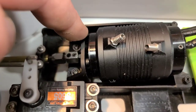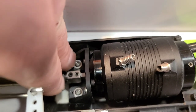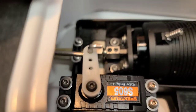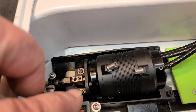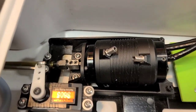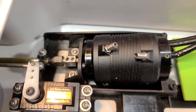I've got my motor screwed up. I've got Loctite on the head screws, and I've got these screws tightened down. My grub screws on the collet have Loctite. I grind my grub screws flat and shorten them up quite a bit to reduce rotational mass. It helps prevent excessive vibrations in the system. I do that to all my driveline grub screws.